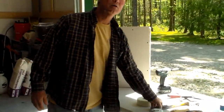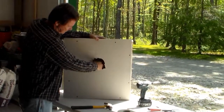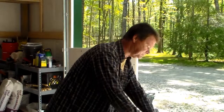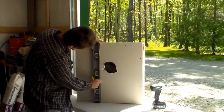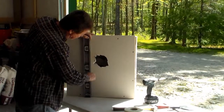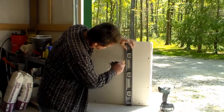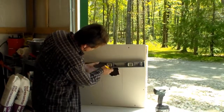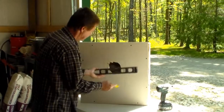We're going to start out by making a big hole — I've made just a practice wall here. As you can see, that's a pretty nasty, pretty big hole. So the first thing you're going to do is get your level and your pencil and set it on here. Level your level up. Make sure you're clear of all the loose debris so you have a nice solid surface. Draw a line, do the same thing on the other side, level it up, go across the top. You're going to level it up and put yourself a line across there. Do it on the bottom as well.